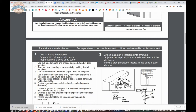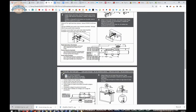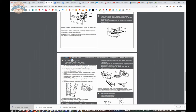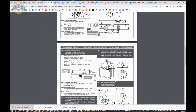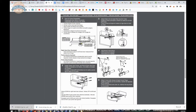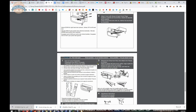The typo comes in right at the top of page two, which is regular arm — they've called it parallel arm. Page three is our top jam mount. Page four is parallel arm. They're deviating from the standard naming — essentially saying push side instead of top jam. So the bottom line: of pages two, three, and four — regular arm, top jam, and parallel arm.